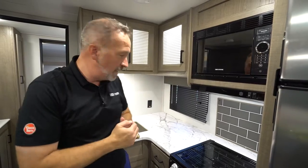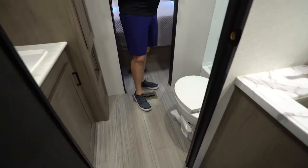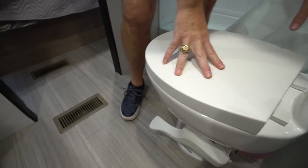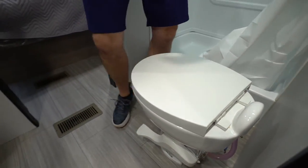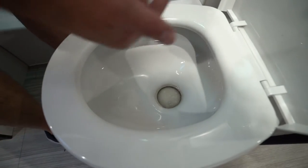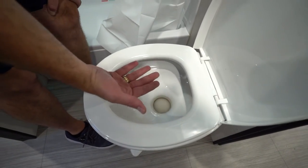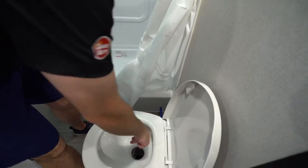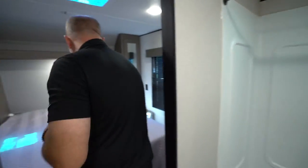In the bathrooms, the Keystone Hideouts have high-rise porcelain bowls with a foot flush. The tube in the back may have a control knob to cut off leaks — not all units have it, but some do. The foot flush activates a little flapper with a black seal. If you notice the flapper is engaged but water is still draining, take a glove and some Vaseline or grease, push the flapper down, apply the Vaseline around the bottom of the rim, and that should keep the flapper engaged.